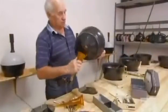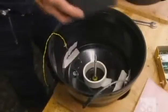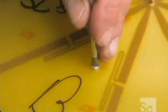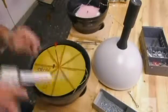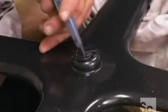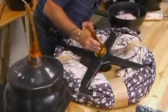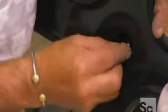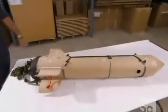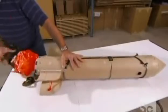Now for the stress relief they molded earlier — it attaches underneath the bottom half of the surface float. Inside the bottom half, they install the battery pack, then a control board, a transmitter, and an antenna. The surface float is made of ABS plastic, with the top surface coated for UV protection because it will be exposed to direct sunlight. They attach one end of the tether cable to the stress relief and the other end to the drogue, reinforcing the connection with epoxy. This type of buoy is designed to monitor only the top yard of water, so it doesn't have a long vertical drogue.